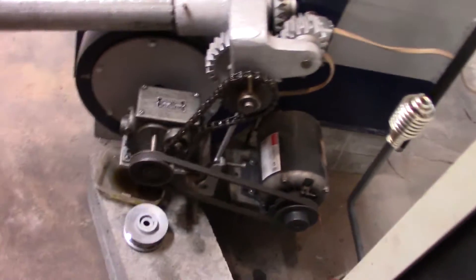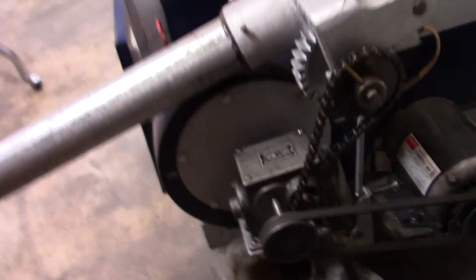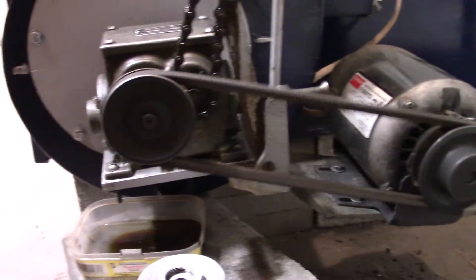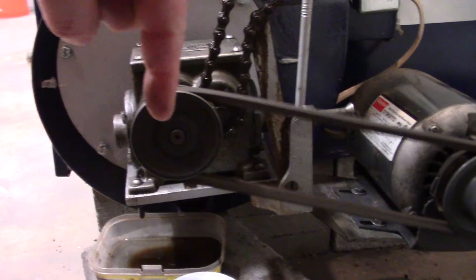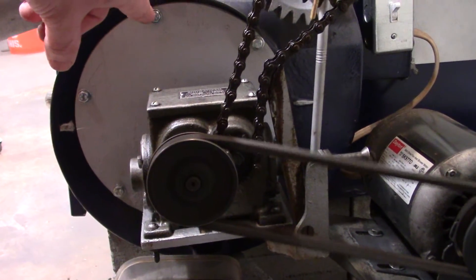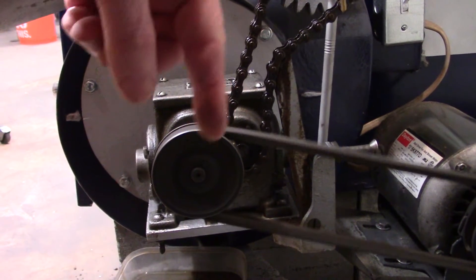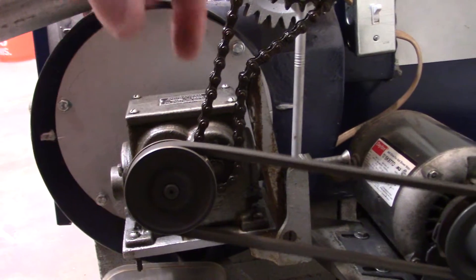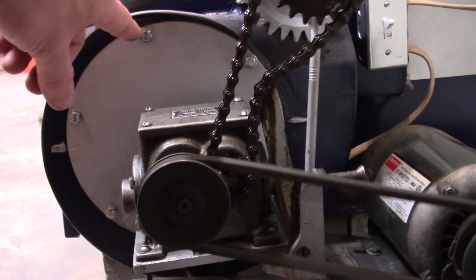The Van Wert is a little tricky because it has a pulley on the motor and a pulley on the gearbox, which drives the blower on the other side here. So if you change that ratio, you actually not only change the feed rate, but also the amount of air you're putting in.